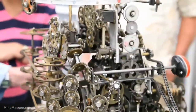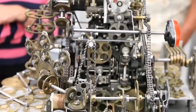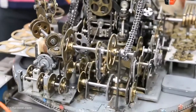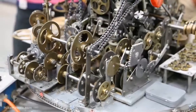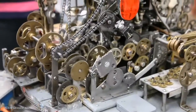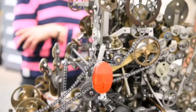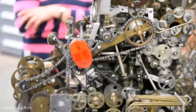That's a part of an oil pump out of a motorcycle. They really utilized a lot of things there. The ball on top is actually manipulated by this device that's intermittently turning. These are cams — one cam will go to the high point, the next one will go to the low point, so it causes the ball to roll this way most of the time.